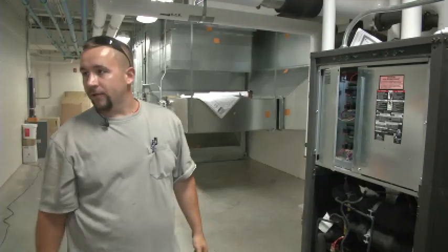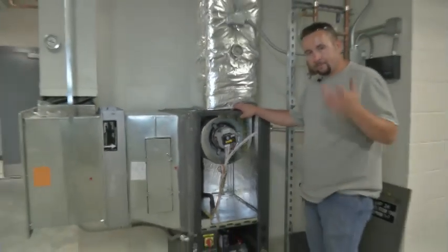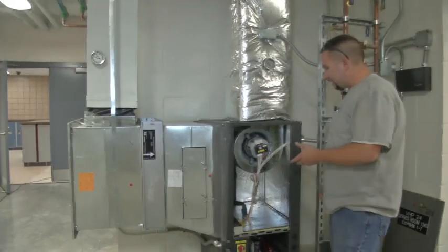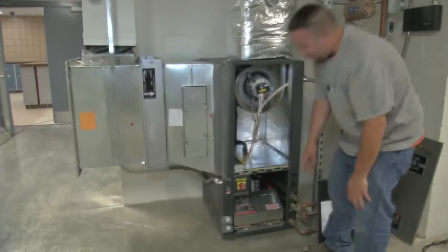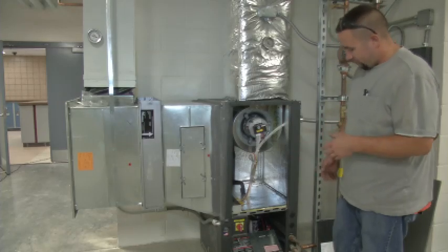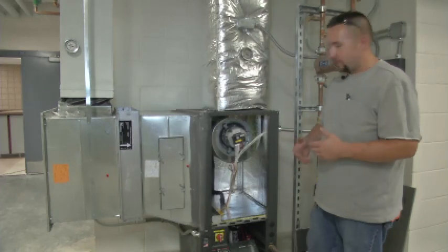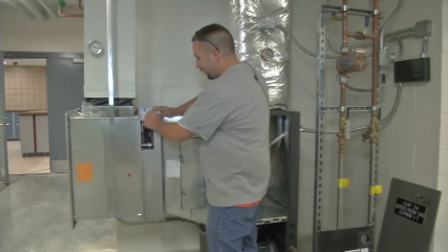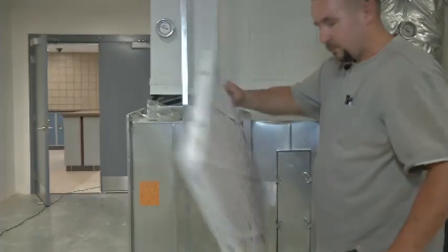We can move to a water-to-air heat pump. These are also heat pumps — same concept: your geothermal runs through as your condenser via these lines here, but you have ductwork that feeds the room. Maintenance-wise, not a whole lot — same deal. You do have a DXM board under this cover with the same LED fault indicators. For annual maintenance, check amp draw on the compressor and fan, making sure everything's within the 10% range. Each unit has its own filter rack with a wing nut — filters right here need to be changed every 30 days.